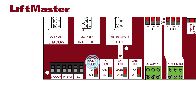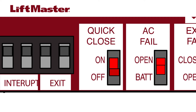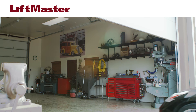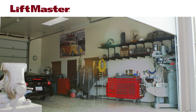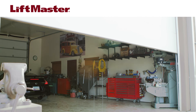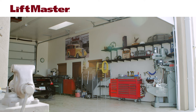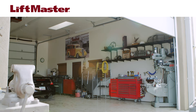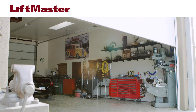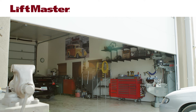The quick close assists with controlling the flow of traffic by reducing vehicular tailgating. When the switch is off, there is no change to the unit operation. When the switch is on and timer to close is on, an opening gate or door will automatically begin to close as soon as a vehicle passes the photo eye or travels over the wired interrupt loop. When the switch is off and the interrupt loop is activated, a closing gate or door will stop and reverse to the open position.